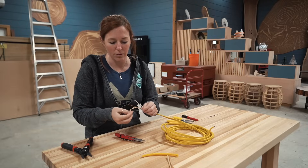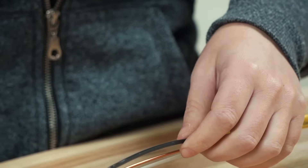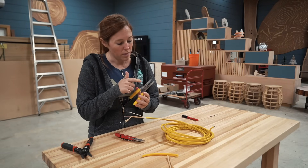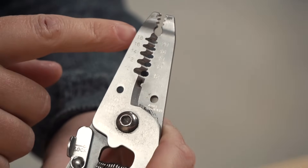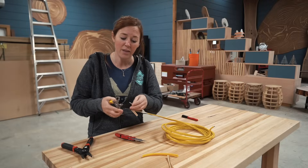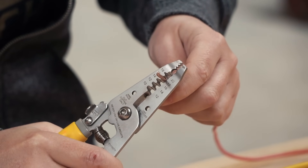Note that there are different types of wiring — solid and stranded. On wire strippers, some have a readout where they differ on either side. For example, this one says 18 on the left and 20 on the right, and these sides are for solid wire. If you're going to be using stranded instead, you just go up one size — so instead of 18, you would go to 16.